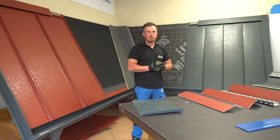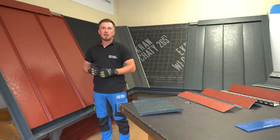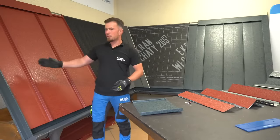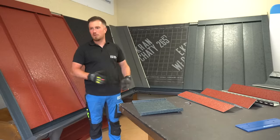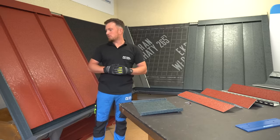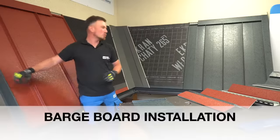When installing a roof, in order to achieve perfect roof symmetry, the amount of needed panels should be calculated and the widths of the first and last panels adjusted. Here we started with a cut panel at the beginning to have a perfectly symmetrical setup. However, it's not a requirement and it is subject to individual taste. There are a number of options for how to finish the roof off on the sides. In this example, we use a wider, bulkier barge board flashing on the grey section and a slimmer barge board flashing on the red section.